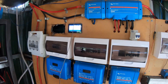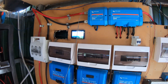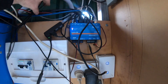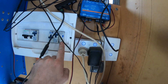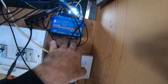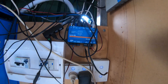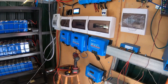Fans are just on directly for now. I eliminated one wire dangling out the bottom of that MPPT and introduced another one — that makes total sense. Power is back on to both MPPTs and working. What I'll do tomorrow is monitor the output from the 250, let it get hot, then enable the fans and see if it suddenly gets better — fingers crossed. I'm going to pull this wire over to the servo controller, tidy up this rat's nest of USB cables, and use these relays here. When any of the MPPTs reach 30 percent of their potential, the fans will come on and run until they don't. I'll show you how to do that tomorrow. I'll be back in the morning, let these MPPTs get hot, and we'll go from there. Cheers for watching.